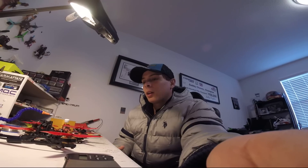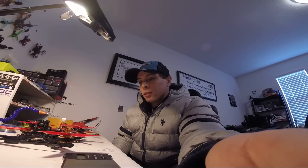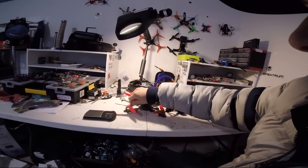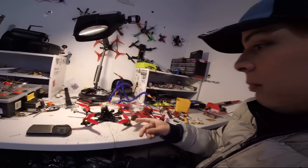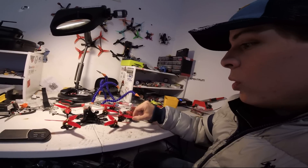The theory is that with higher voltage there is less current draw, assuming the same final RPM. What I've got here today are two identical quads — same flight controller, same firmware, same components, same exact motor specs — except for one thing: the KV of the motor. On this quad I've got the Catalyst Machineworks high voltage revolution motors which are 1725 kV, and on the other quad the Brother Hobby R5, wound to 2650 kV.